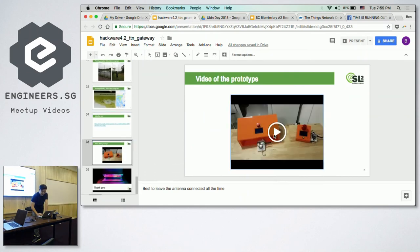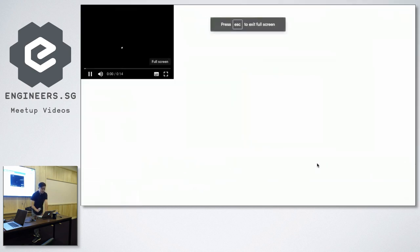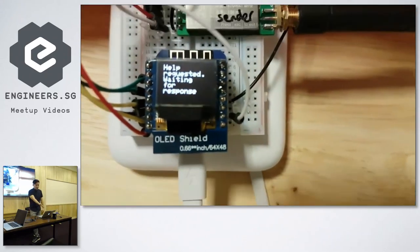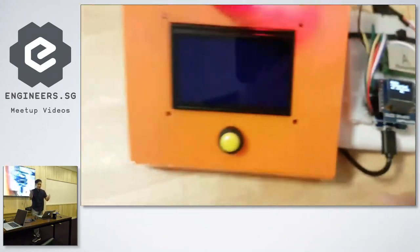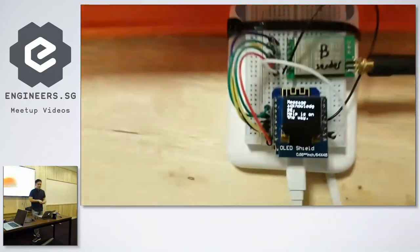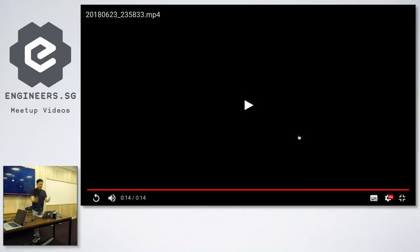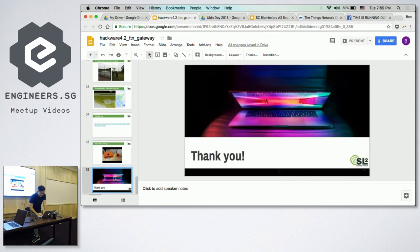This is a prototype that I built. We used LoRa — not the full LoRaWAN — just a simple one-to-one setup to show the proof of concept. So help is requested: you press the red button. The medical center sees an emergency alert — 'help requested, station number one.' You press the acknowledge button and it sends back 'help is on the way.' Then you see a signal at the help station confirming that help is on the way. It's very rough, but that's the prototype.